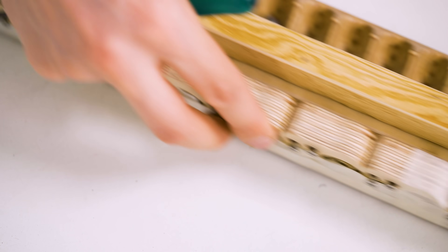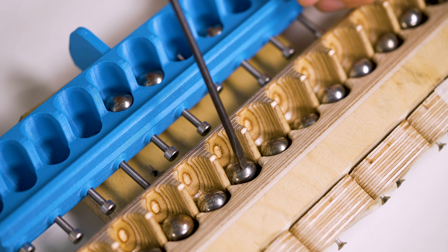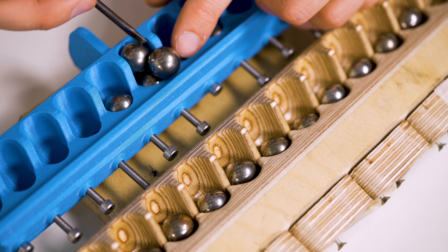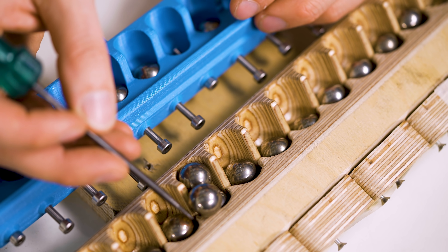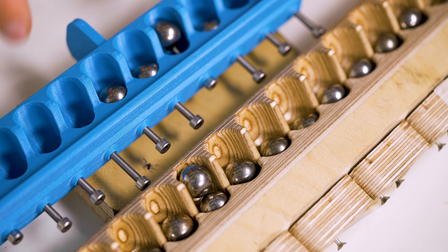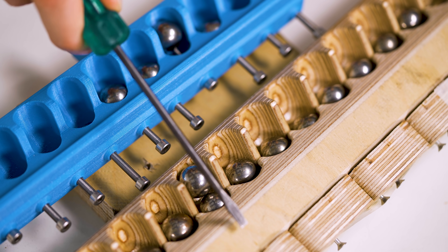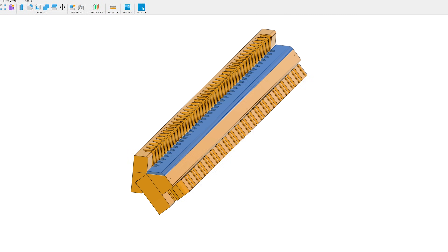That was my first mistake. For my second mistake, we have to look at it from the other direction. I rounded over these walls — I worried about the marbles chewing up the plywood, so I made a fillet around this edge. On the 3D print there's a sharp flat edge, so the marbles can pass pretty easily and the divot between the marble and the wall is small. On the plywood version, that divot is much larger. Shapes is one dimension and material is a completely other dimension — plywood has its limitations, and in this case it's just not possible to make these sharp structures from plywood. So maybe I could machine this from another direction. I made a CAD design of a top sleeve, cutting off the top of the old parts and adding this new top sleeve. Here's the CAD for a machining test part in POM.